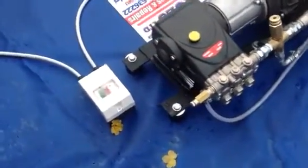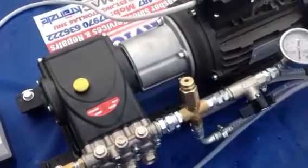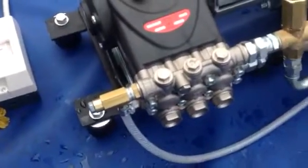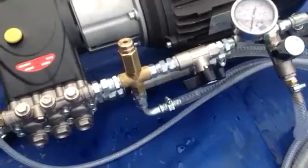There's a thermal overload switch in the system. We've got a safety valve here — this system is working at 250 bar, up to 250 bar at 11 litres per minute. We've set this at 260 bar so if it goes above that, anything happens on this valve and it will automatically blow off for safety.